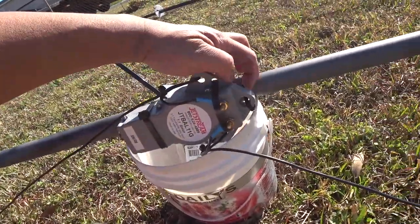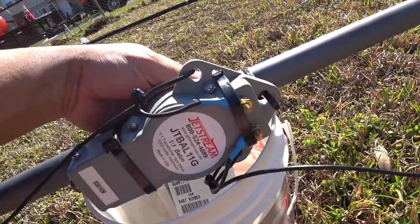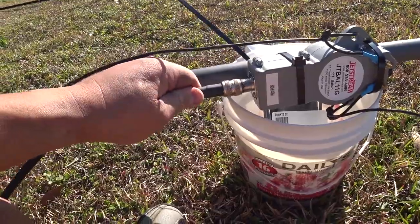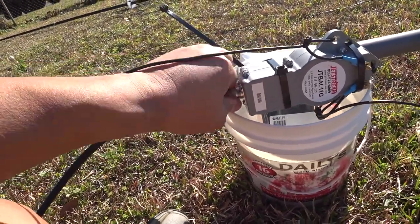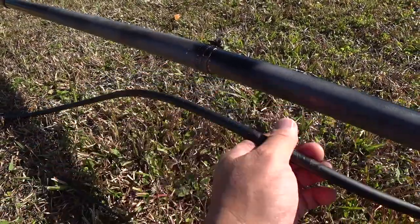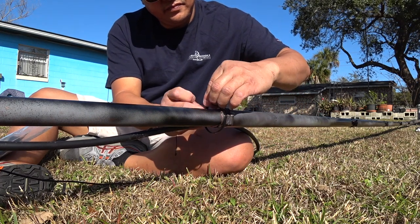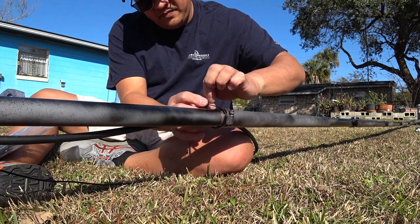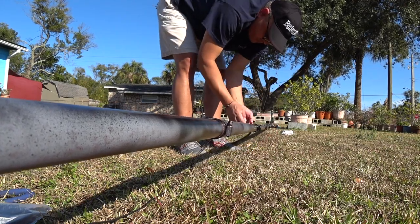I had to make a change. Instead of putting two on the top, I had to put it here — I went through that hole on both sides, so it's nice and snug. I'm going to install that here, and tie-wrap the coax cable along above the hose clamp, and run the coax. I got the RG-213 tie-wrapped to the pole of the HF mast.